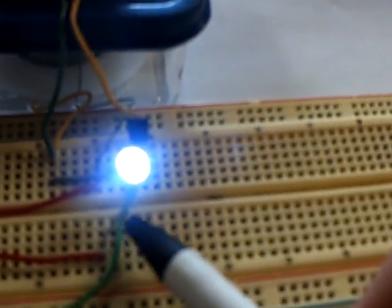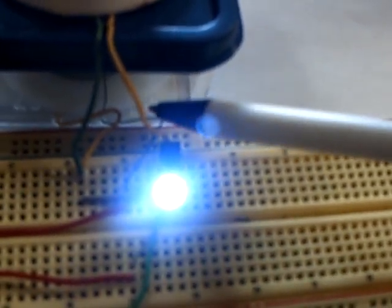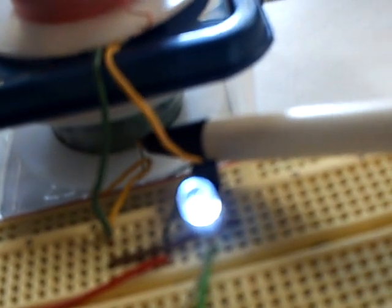It's a self-oscillation, and it actually charges at this point right here on the back EMF coming off the collapsing field of the coil down into the drive coil. This is a mismatch in windings, by the way — there's 75 feet of 26 gauge and 200 feet of 30 gauge — so it's a mismatch. It's like a transformer setup; it's not a pure joule thief.